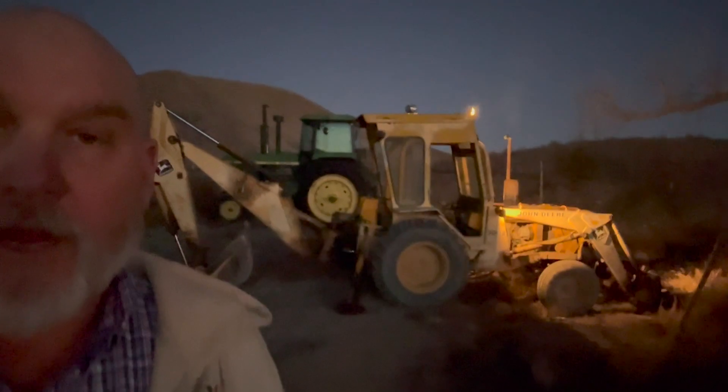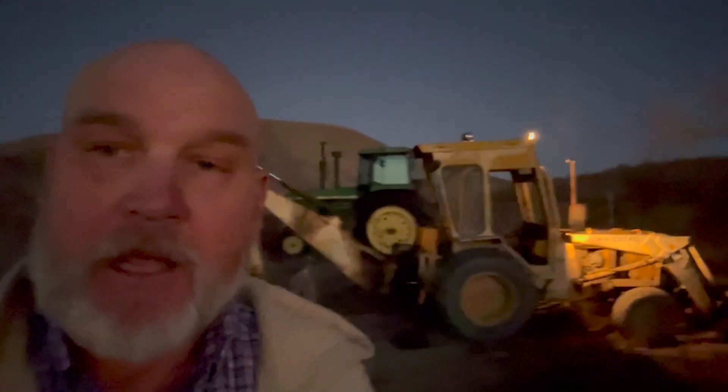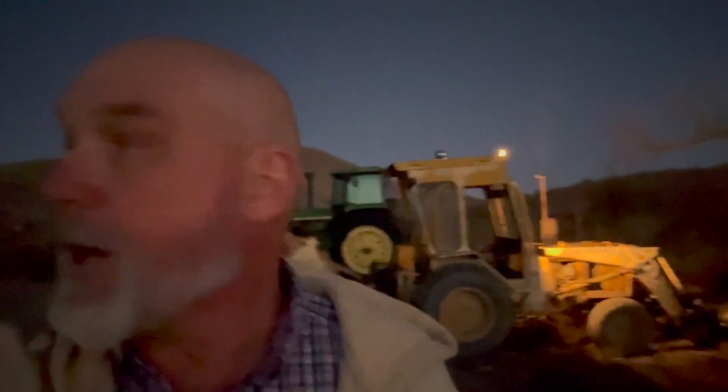Hello everybody, getting a little video tonight. I've been having trouble with my backhoe — I got it warming up just a little bit, you guys can see it back there. The front end loader essentially quit working: the lift of the lift arms and the tip of the bucket. It's going to be a little noisy with the tractor running, but I want to show you what I've got. The interesting thing about John Deere stuff is they've got a great website, and this control valve stack has a relief right in the valve stack. I'll show you what it's doing so you guys can understand why I think it's the control valve or the relief valve.